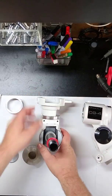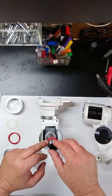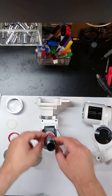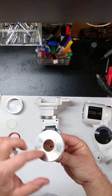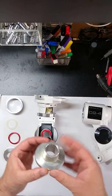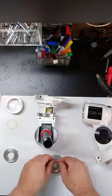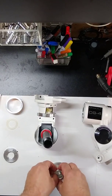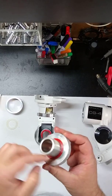A good way to set this up is to have it vertical. I've started by putting the smaller fiber disc on the shaft — already greased. These can tighten up over time, so it just takes a bit of work getting over the threads and down the shaft. The worm itself has some grease on its surface. This is where the inner fiber washer sits, and the other fiber washer comes out on the outside of the worm. Work it on, slide it down, and that's been greased on both sides. The worm wheel has been greased as well.